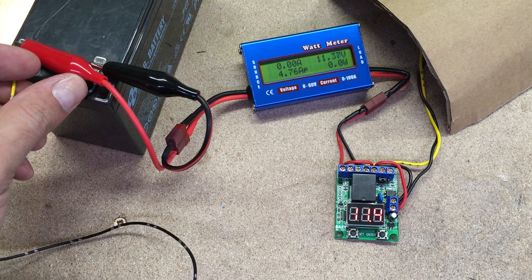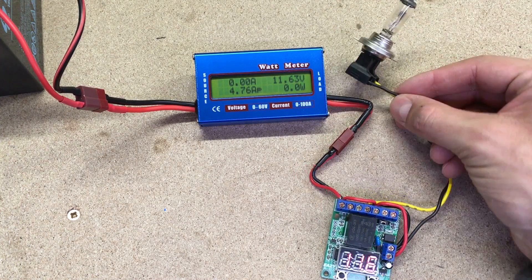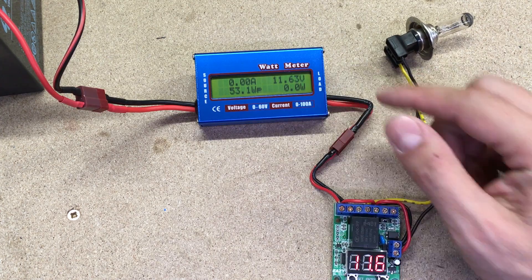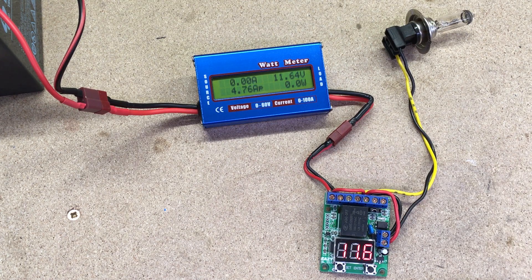This function could also be useful if you want to bottom balance your batteries. By using components for around 50 euros, you could get a cheap and accurate battery capacity tester. One more great feature: by using bulbs with different power ratings, we could get a specific load amperage. For example, to increase amps, add more bulbs in parallel. To decrease amps, use less powerful bulbs.